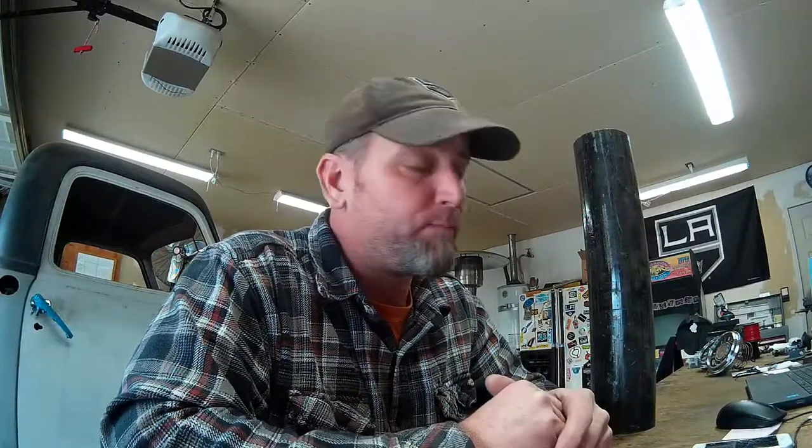It's a piece of 4-inch Schedule 40 pipe that I'm going to use for my exhaust cutouts on the transmission crossmember. The reason I had to go with the 4-inch Schedule 40 is they didn't have 3.5-inch HREW. So I couldn't get seam tubing, hot rolled electronically welded seam tubing, in the size I needed to provide a good buffer around our 2.5-inch exhaust tubing.